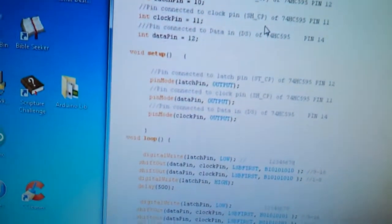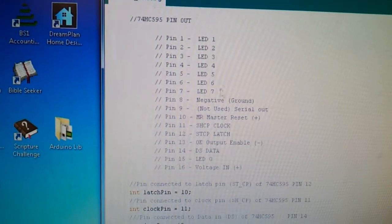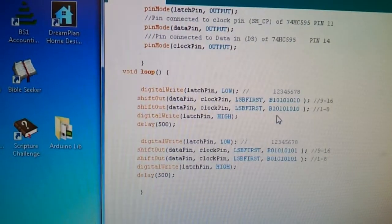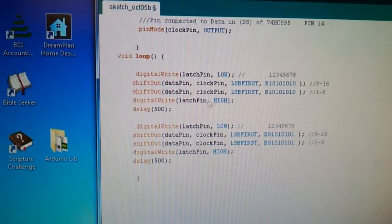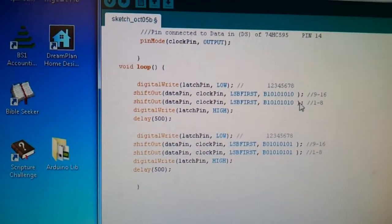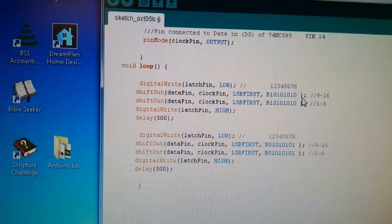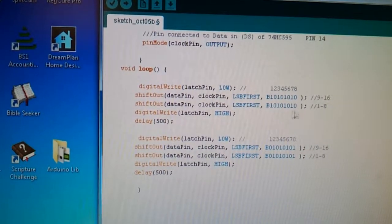Let me show you the code quickly. Here's the pinout, pin 1 through 16, going out just like the first card. You declare some things, do the setup, set pin mode, latch pin output, and so on. In the void loop, here's where all the fun happens. The latch pin — as soon as it goes low, that enables the data to be received. So the Arduino shifts out a byte. This is LED 1, LED 2, 3, 4, 5, 6, 7, 8. The first byte controls LEDs 9 through 16, and the second byte controls LEDs 1 through 8.